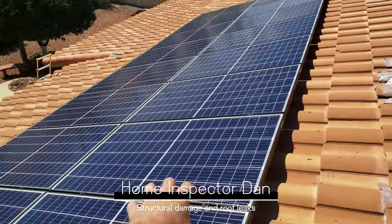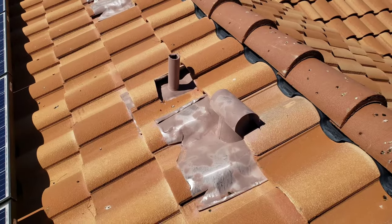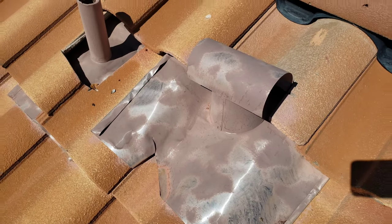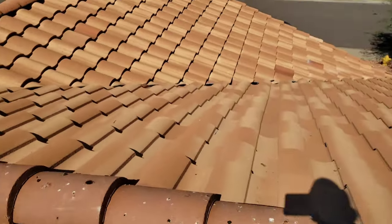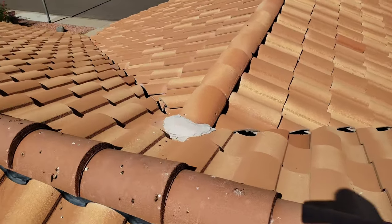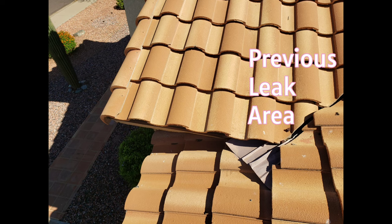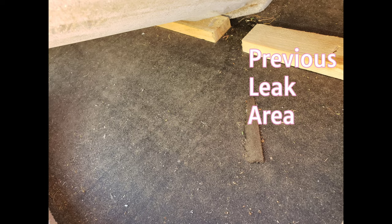At this house I'm up on the roof. We've got some solar panels mounted and all the electrical wires are going off that side down to the electrical panel. This roof has been replaced not that long ago - we can tell by the mortar caps - but the flashing they put on was just sporadically sprayed. We really want to see this cover the whole area; the last thing we want to see is rust. The roof surface in general looks really good, but these mortar caps wear out after a few years.